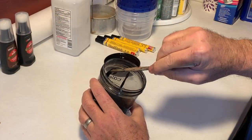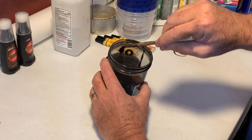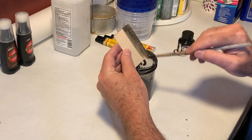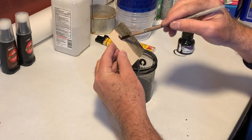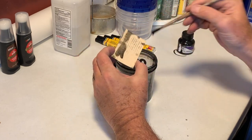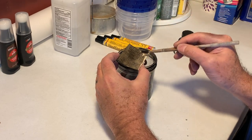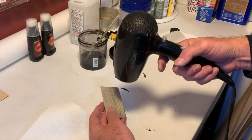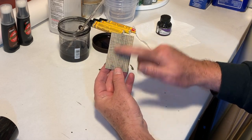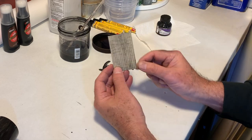Looks about right. You can see how opaque or how transparent it is. I'm just going to try it on this piece of basswood. It's going to go on darker than it's going to dry — this will dry a little bit lighter. This is really thin basswood so it's going to warp, so a good trick is to go ahead and stain the backside too, even if it's not going to show. Stain the backside and it'll dry much flatter than if you didn't. When that's completely dry you get this nice kind of silvery stain, which is very reminiscent of old wood that's been out in the weather for a long time — almost kind of a driftwood color.